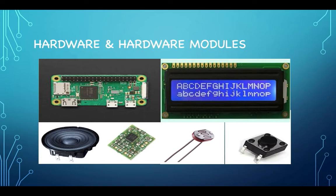The Pi, which is at the top left, is capable of connecting to all other hardware peripherals. These include sensors like the light-dependent resistor at the bottom right next to the button, push buttons, and output devices like the speaker at the bottom left. Due to the high number of GPIO pins, it allows us to connect a lot of devices and easily scale our project. It has various interface capabilities including I2C, UART, and SPI, just to name the most ubiquitous of them.